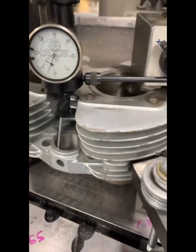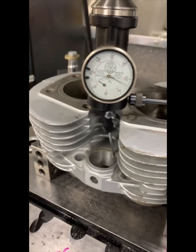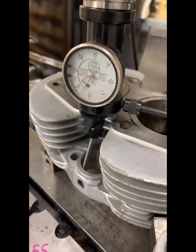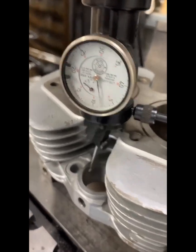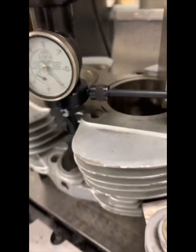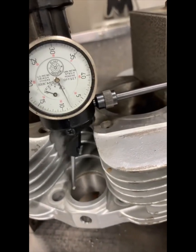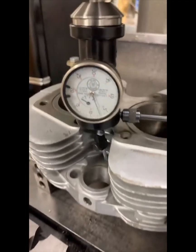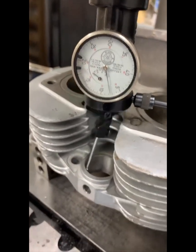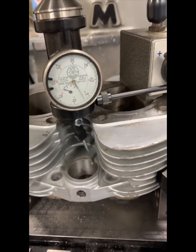So I have the coax set up. Basically what we're doing is finding the center. I would prefer to use my other indicator but considering it fouls up, this one's got a lot more clearance so we can get it rotating. I typically set it up with a coax when the machine is off and in neutral, then fine-tune it with the handles. Theoretically speaking it doesn't have to be absolutely perfect because we're just setting the flange to where it's going to stop. What's more important is making sure that the base is parallel to the table and square to the hole that we've already bored. Off camera I'll get this sorted and then we'll get the boring bar back on.